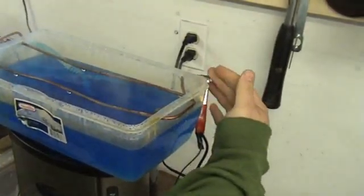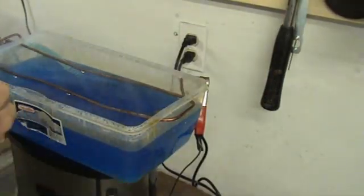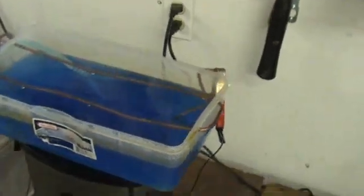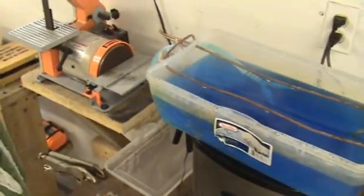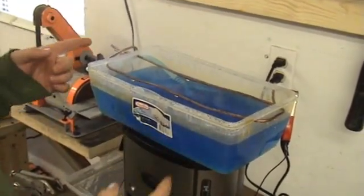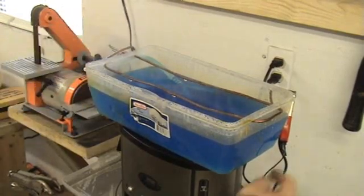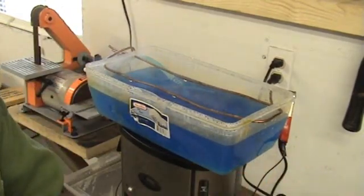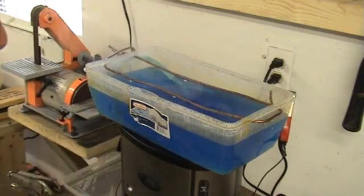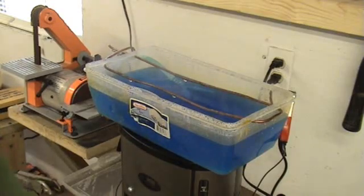Your positive is here, coming into the box through a drilled hole, and I just have a strip of wire running right down inside the box the whole length. There's no contact between the negative and the positive — the negative is not touching the solution, the positive is in the solution. When we hang our bullet into the solution it completes the circuit, and that's our electroplating.